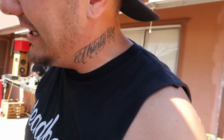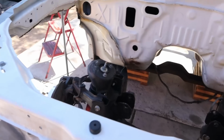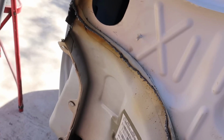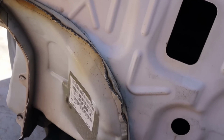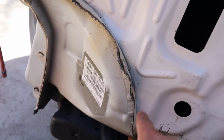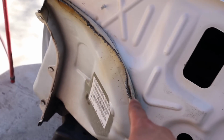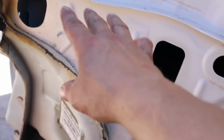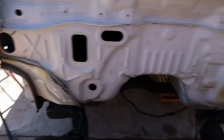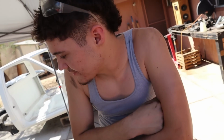I think this was definitely a job well done. This is much needed real estate inside of this. So now we need to go through and obviously clean the cuts up, use a soft disc, and we don't have a belt sander unfortunately, but we need to try to pop the spot welds off of that section that's still on the firewall. And then you just take the rest of that off, and then the firewall will just be solid. You won't even be able to tell where it was connected, after we paint it anyhow.